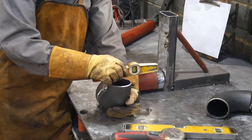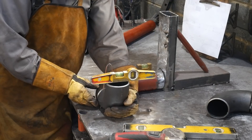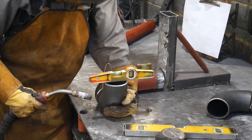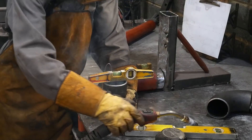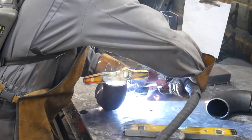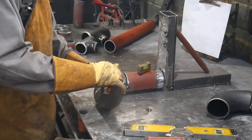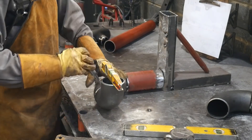The pipe you see in this video is Schedule 20 and the welding specification is up to a Class 2, so it's not going to get X-rayed — chances are it would probably get ultrasound tested, non-destructive tested. But it's nothing high pressure or low pressure; usually chilled water runs through these pipes. So the welding isn't absolutely critical, but still it's welded to the specifications of this job, so bear that in mind before you drop in the comments saying why am I doing this, why am I doing that.